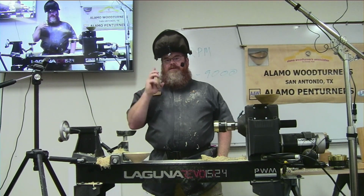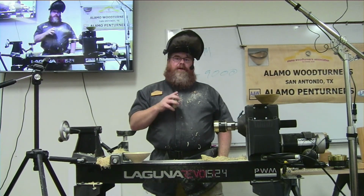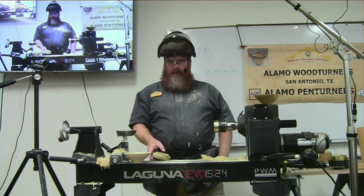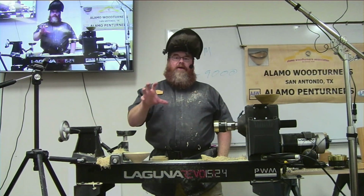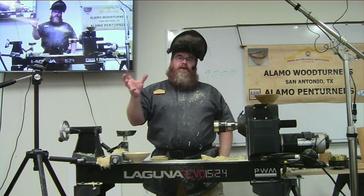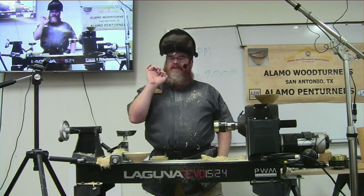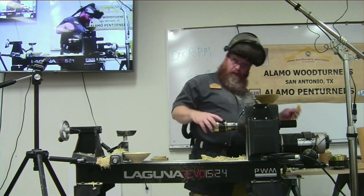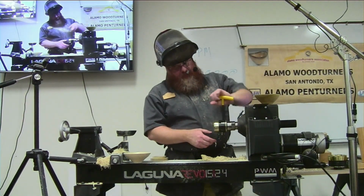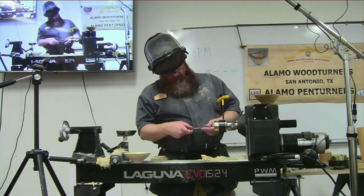Any questions? Yes, sir. Why don't you like recesses? They're just too weak. With recesses, you're adding stress to the bowl and not taking away from it. Don't get me wrong, I've made a lot of bowls with recesses, and if I'm doing a platter, I almost insist on it, because gripping a tenon on a platter, you've got that ugly thing sticking out. When you want to measure for a recess, you want the chuck fully down, and you want to measure that gap right there.